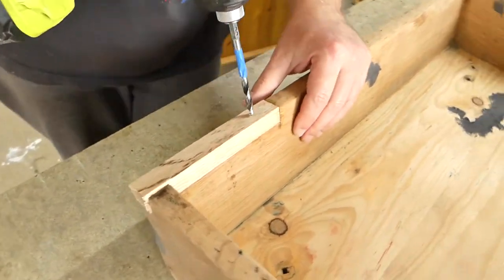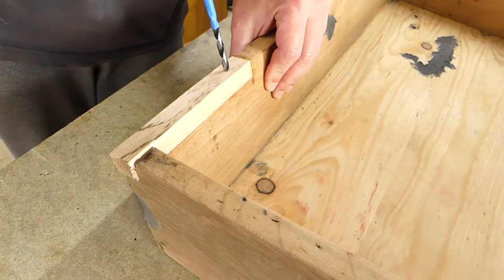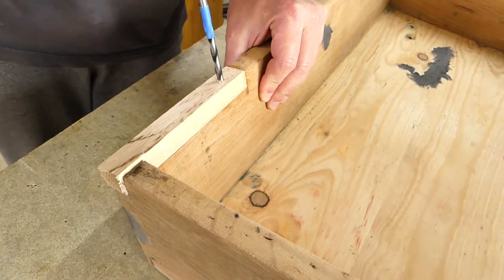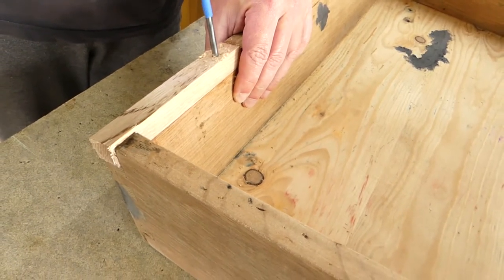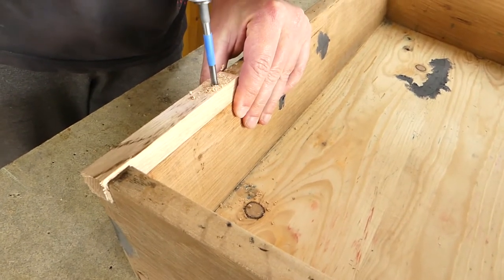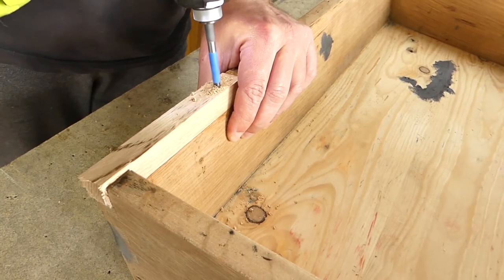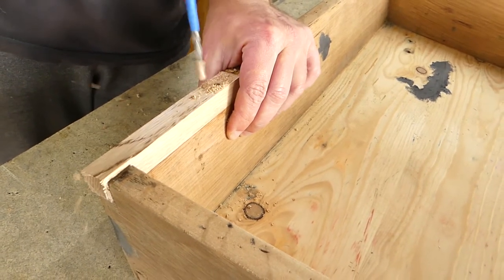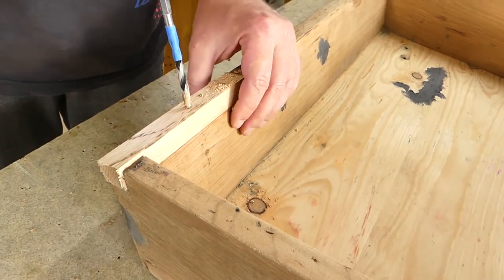Another important job that we had to do is to fill out the missing chunk of the wood from the desk. So we cut it to make it square and Lucas glued another piece of oak wood to fill the gap, and then drilled the holes through it and put the wooden dowels in to make sure that it's not gonna fall apart by mistake, so it will hold nice and tight.